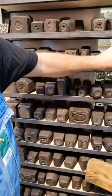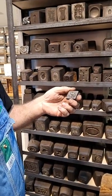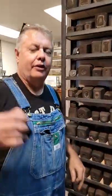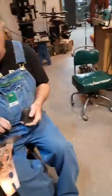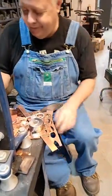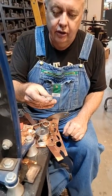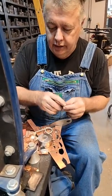I like to press solid. If I press solid with copper, I've made a force. So if you're pressing solid, just ignore this. You're already doing it, you don't need a force. But if you're pressing sheet, this will help you. If you're pressing solid all the time, then just go on about your day, you don't need to watch this. As you've seen, when you press solid, you can get all your detail because you've got something heavy behind it, pushing all the metal right in.